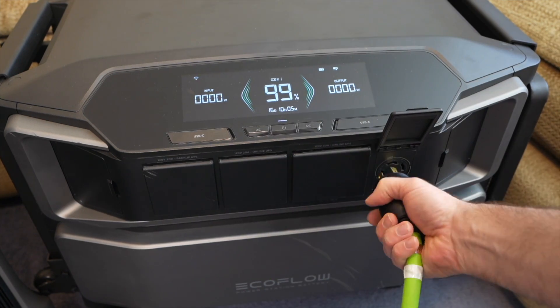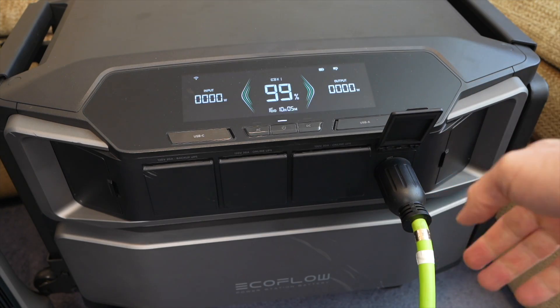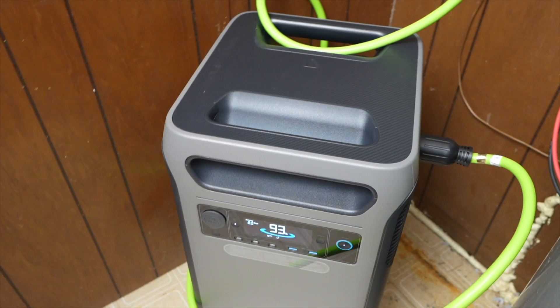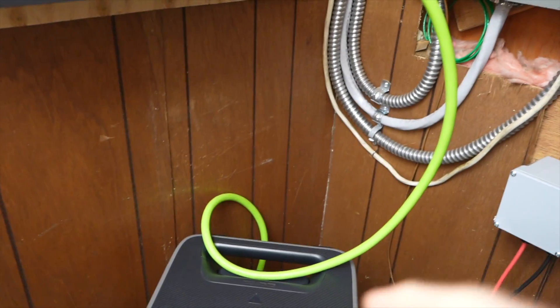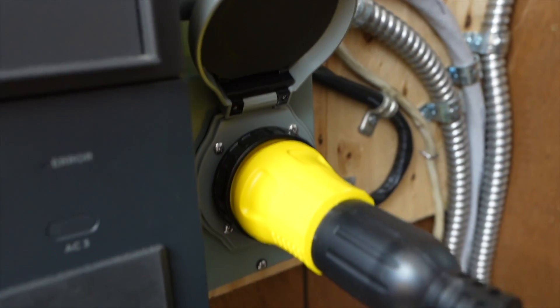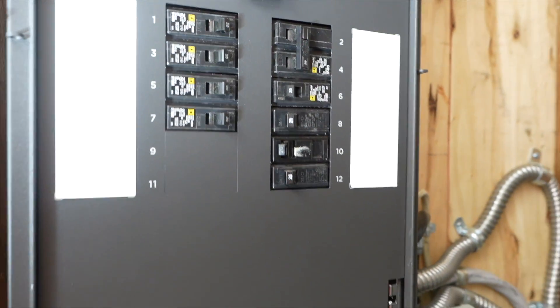You can just get your generator cable, plug it in, and twist it to get the 240-volt output. These power stations also stand out as good options for home power backup or to save money if you have time-of-use rates. For home backup, you can use them as a drop-in replacement for a gas generator — here I have an inlet box plugged directly into the side of the battery, and it runs a critical loads sub-panel.